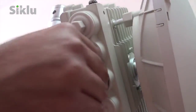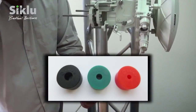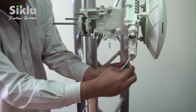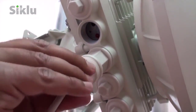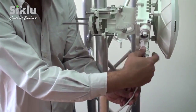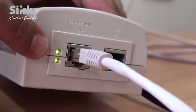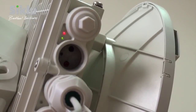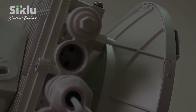Connect the Ethernet cable to port RJ1 of the ODU. Select a rubber gasket that best fits the cable diameter — note that the rubber gasket is spliced and can be assembled on cables with connectors. Secure the all-weather shells by hand only; do not use tools. Power up the ODU by connecting the Ethernet cable to the data and power output port of a Power over Ethernet device. The power LED illuminates red and then blinks green until the ODU has fully booted, a process that lasts approximately 90 seconds.